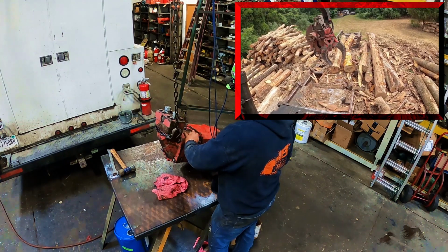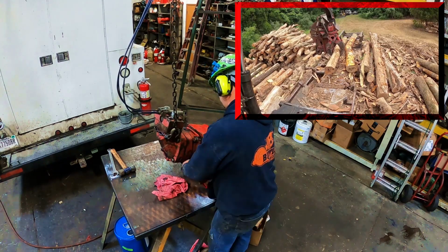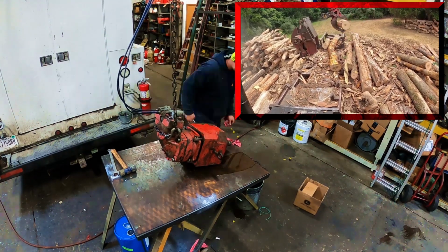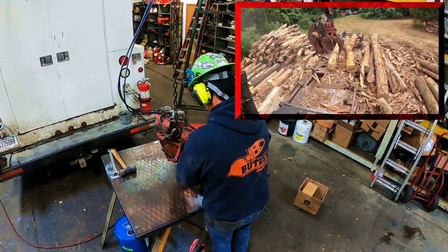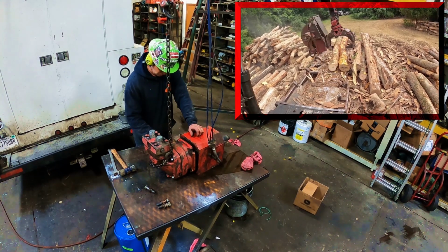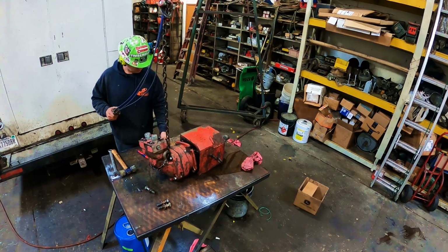It's a big hydraulic motor, and what this is, it runs a saw blade on the cat boom, and the seals went out of it, and we kept running it, and it's oozing oil. We ran like a year and a half oozing oil out the saw blade seal, which is a bad idea. Y'all got this set up in y'all's logging operation. Don't let it leak.